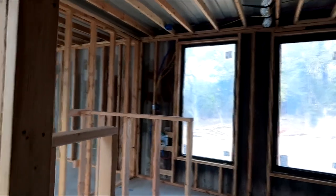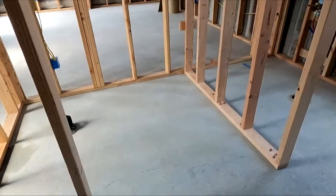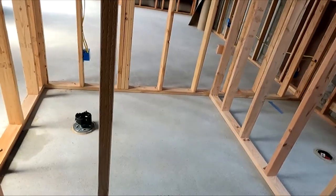This is March 9th. I spent the day putting up one extra pony wall in the apartment bathroom and one extra one in the master bath for the toilet area. Derek Penner came over - he's doing our cabinets - to measure everything up, and he's going to start working on the plans. Then we'll get the finishes approved with the missus of course. Here's the master bath right now - you walk in, there are the pony walls, and then you have access to the shower area this way. There'll be a little ridge - I'm going to make that concrete, roughly an inch and a half up and then sloping towards the drain.